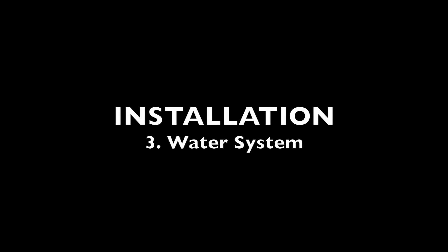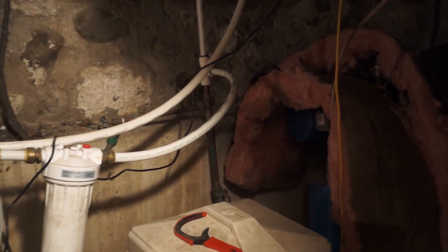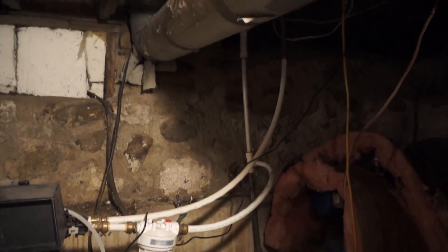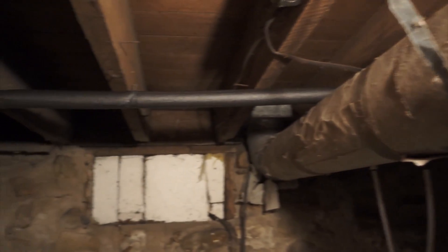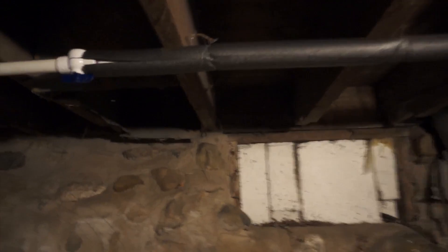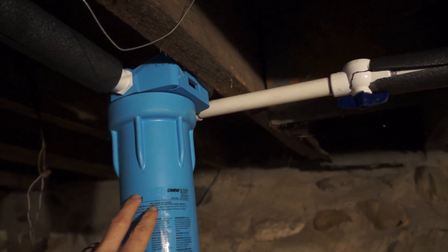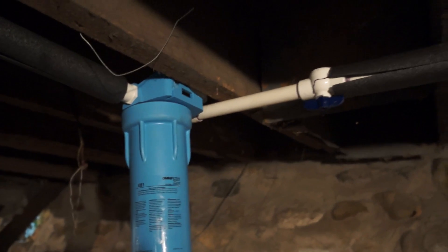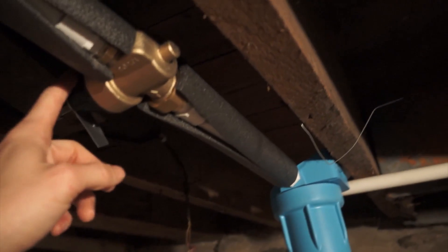Maybe the most interesting part of the installation was the water system. We begin by looking where the water comes in from my well. I have a shallow well pump which is actually in my basement and not in the well itself because our water table is only 30 feet or so. The water bypasses the water softener system and runs up along the bottom of the floor joists. I installed a shutoff valve just upstream of the sediment water filter to keep any sediment from backing up inside the coaxial coil of the geothermal system. Our water is fairly hard, so I'm not sure how long our coaxial heat exchanger will last — that will probably be the first thing to go in this system.